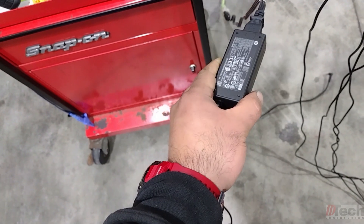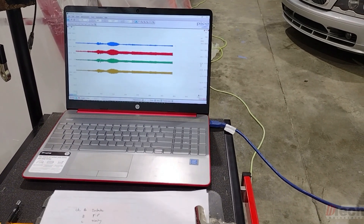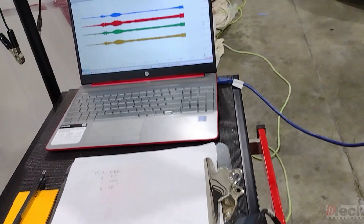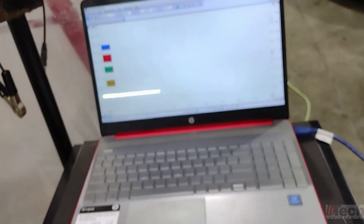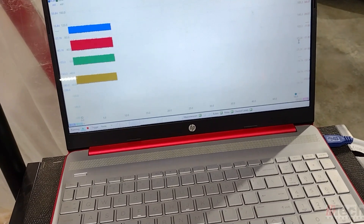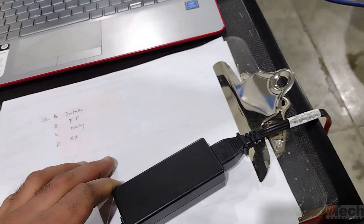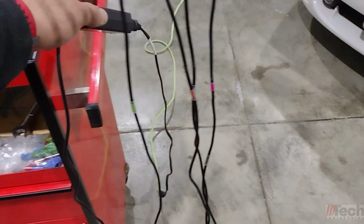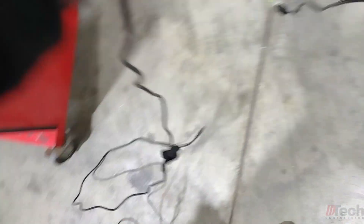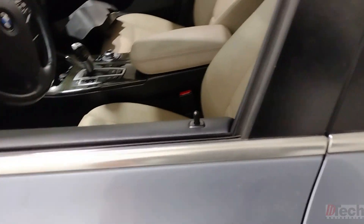Another warning: due to the AC sensitivity of the microphones, simply laying the charger cord near the setup causes noise to come up and increase. Even unplugging the charger from the laptop may not get rid of the static noise if the cord or box is resting on the same cart as your laptop and scope. Not only unplug it, but also remove it from whatever cart you're on, and the noise will go away.